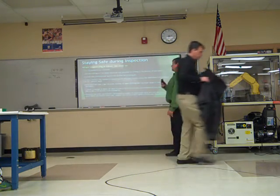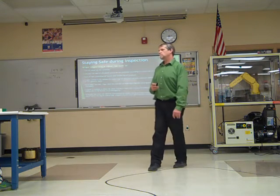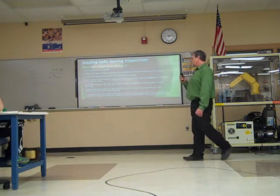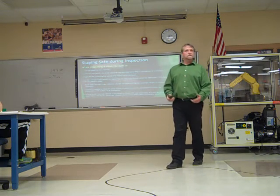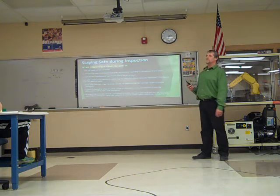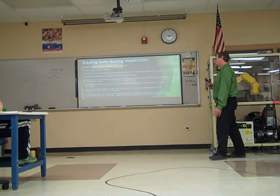If the robot has to be on to do your maintenance, obviously you're going to have it on. But if there's no reason to have it on, don't turn it on. Leave it off, do whatever maintenance that you're supposed to be doing. Okay? Again, watches, rings, ties, scarves, things like that could cause hazards. You shouldn't be wearing them, even if you're in there for maintenance, even when it's off. You never know when somebody will do something stupid and turn it back on. You shouldn't, but you never know.